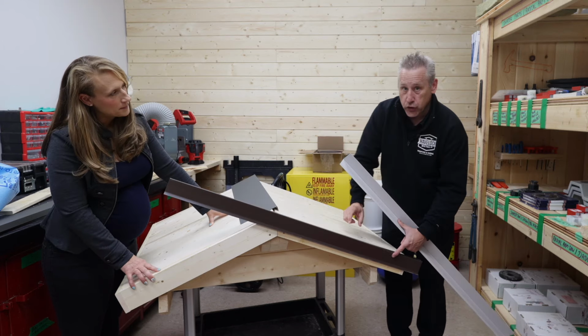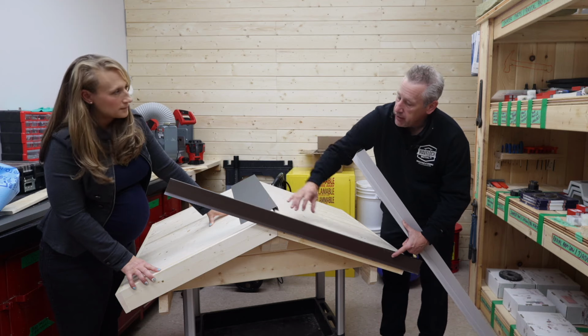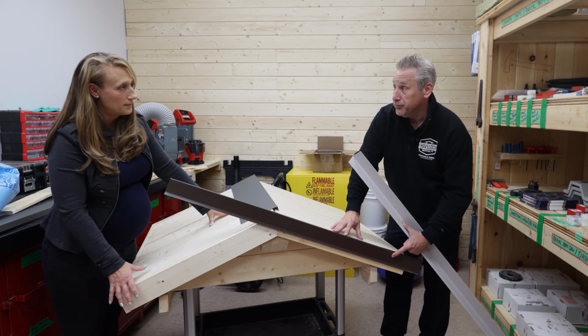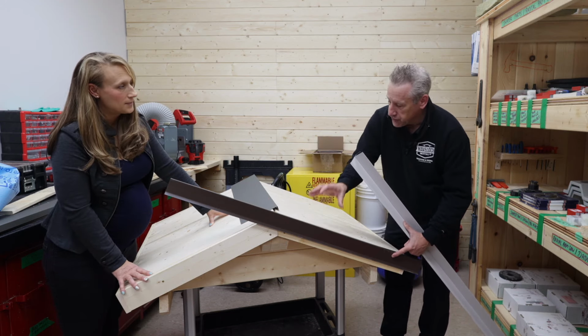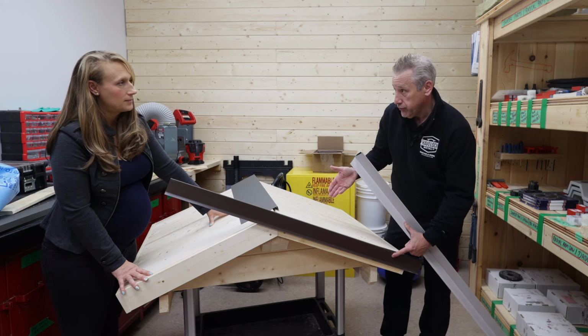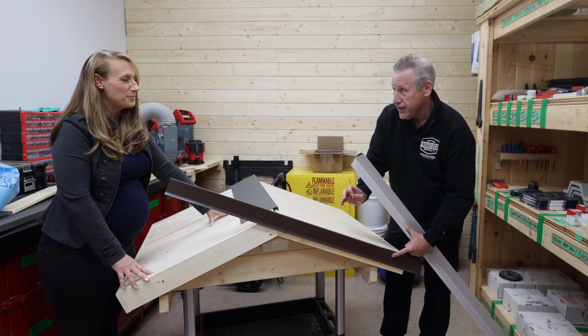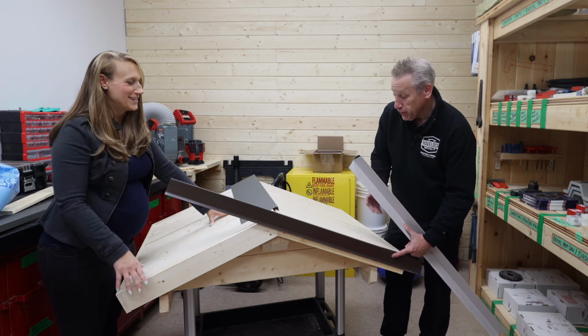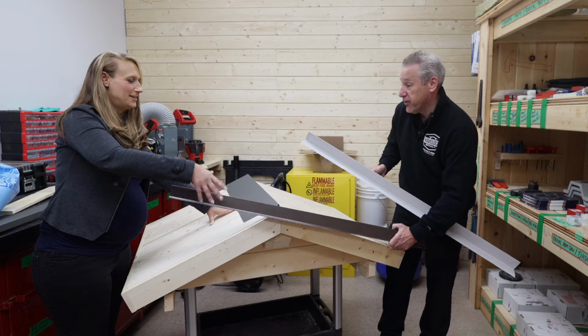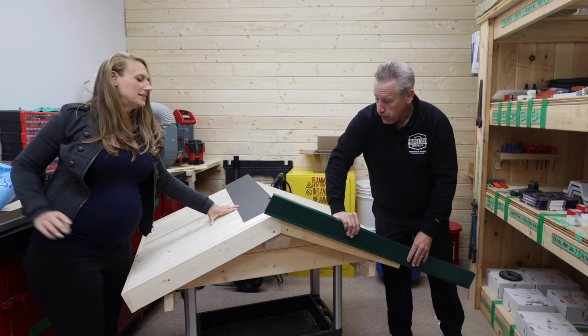Okay, so this is a traditional one. But on the traditional version, you're supposed to then overhang your sheet. You have some exposed area up here. It's a lot easier to install and work with, but it really doesn't do a lot for you. And when you put your sheets on, there's some cutting involved. Unless you're really experienced at it, that cut can get a little wonky. It'd be nice to hide that cut edge, which is why we make the flying gable, or the F gable. I do like flying gable. So it basically comes in over top.